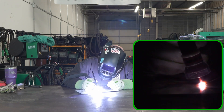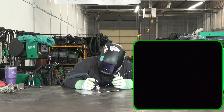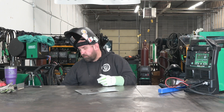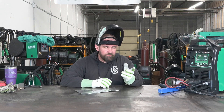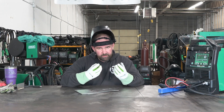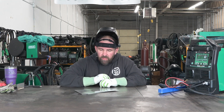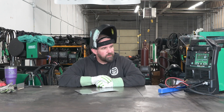Let's make another run — doing a little more of a pedal pulse while running the higher frequency machine pulse, just to show you the results. We get a nice taper out. If you've been following the channel, we just had a DC TIG dual pulse video come out — kind of the same concept. When you run a high frequency pulse and also do a foot pedal pulse, that's a rigged dual pulse method. The foot pedal pulse helps pull heat out of the weld, while the 150 Hz machine pulse helps stabilize the arc. We got a much better run doing that combination.